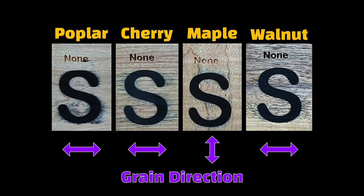What you see here are all the unsealed samples placed side by side and oriented by species. Poplar is first, then cherry, then maple, and finally walnut. All the pictures will have the wood in the same order and the same orientation. In this test, all the species had some amount of bleeding as expected. The poplar is perhaps the worst of all, with walnut being the best. There's not a lot to say here other than don't pour colored epoxy on unsealed wood.